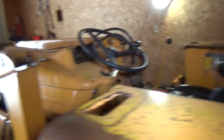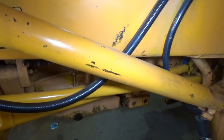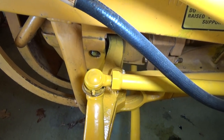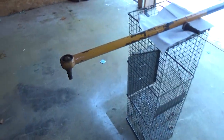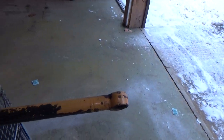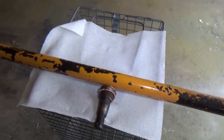The steering rod — you can see the tie rod end on it — comes up and there's another tie rod end right there. That one's the one I made; the original one is junk, it didn't last. You can't get it anymore. They just had plastic in there holding that tie rod end and they wore right out and literally fell right out.